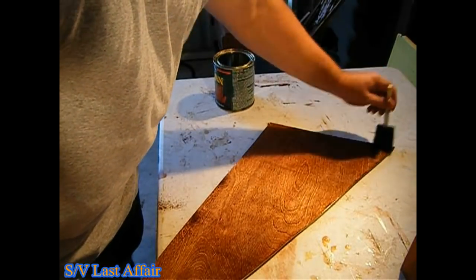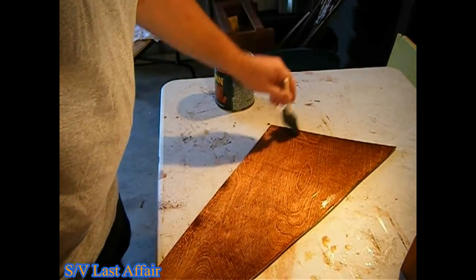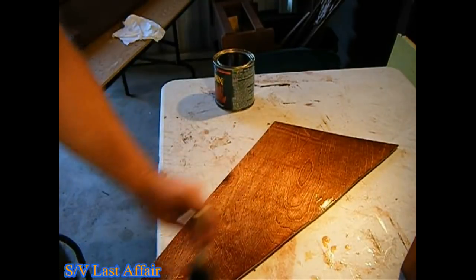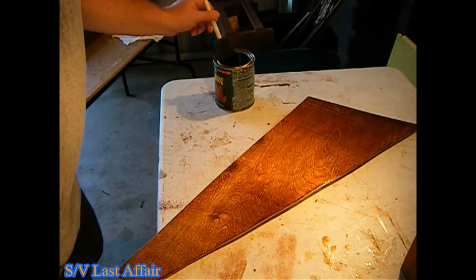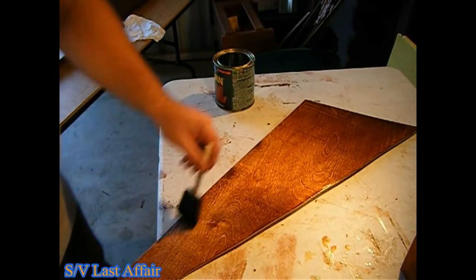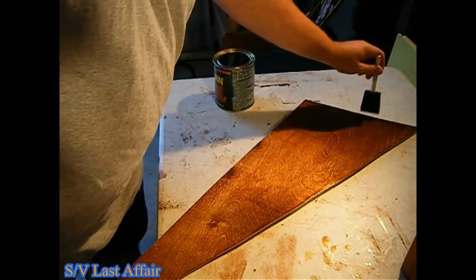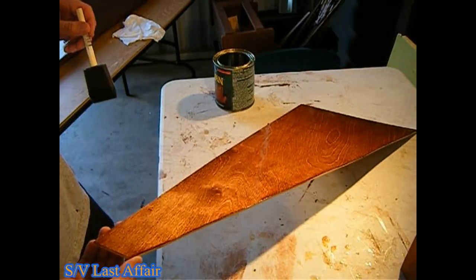Because it's on the floor, we'll definitely put quite a few coats on this one for extra protection where we step on the corners getting in and out of the bunk. I'm laying the varnish on here and will thin it out in a moment. I'm trying not to run along this rough edge because I don't want to tear up the brush or get little pieces of foam into the varnish. Once I've done that, I hold it up and make sure it looks good — and it does. Hopefully the light's showing on camera because you can see those strokes pretty well, which is a good place to varnish as it gives you good visibility.